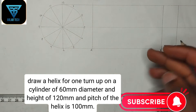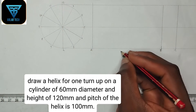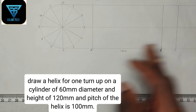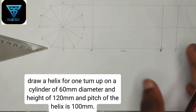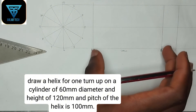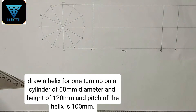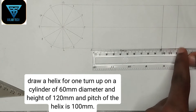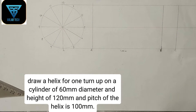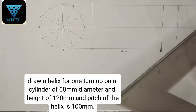We are going to divide this box — which is 100 mm in length — into 12 equal parts. If we divide 100 mm by 12 normally, we get approximately 8.33, which is not accurate enough to pick on a ruler. So we are going to use the method of division of lines for this.